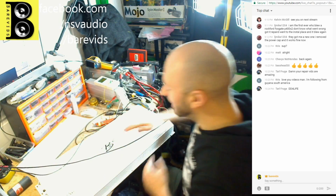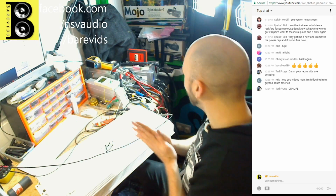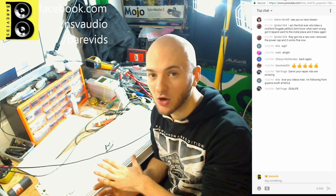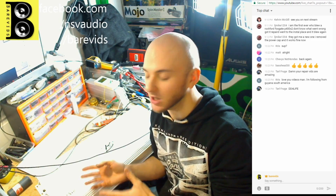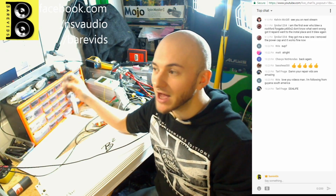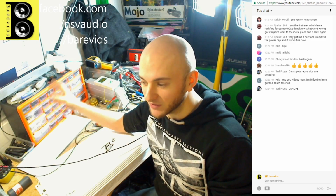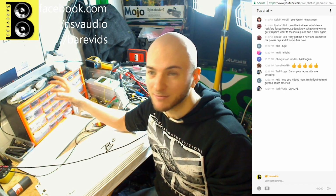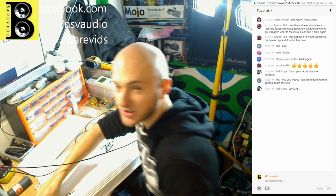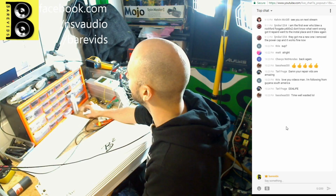So we're back together again. We're back in the case. Amplifier's been reassembled, so we're going to do a bench test. So there was either nothing wrong with this amplifier from the word go, and it was just a wiring issue with the customer's car, or I did replace the TL494 chip and I did reflow some of the solder joints around that area. So if there was a fault, then I have sorted it by messing around doing that, trying to find the fault that was just the amplifier in protection due to low input voltage. So yeah, that's annoying. Time well wasted.